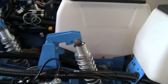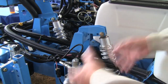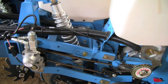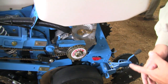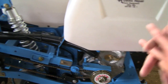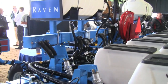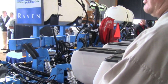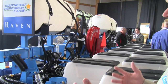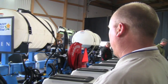The major hardware components are the same exact motors we've been selling for the last three years, built off the Omni roll platform. The valves, encoders, and seed sensors are all exactly the same. Really, the bulk of the technology is wrapped up in the display itself and how it controls those hybrids. With this setup we haven't limited the operator — he can variable rate, straight rate, do multiple hybrids, and manage it on a per-row or per-planter basis.